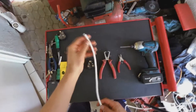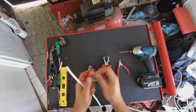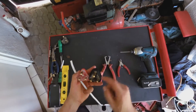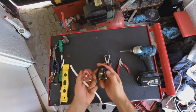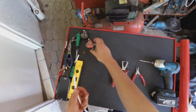This is a 16-amp wire. I've got this UPS plug here just for show, just to show you the different plug types. You see the UPS plug is ground down on the top. The UPS plug can fit in the normal plug socket, but the normal plug socket cannot fit in a UPS plug socket because of the ground-down portion.